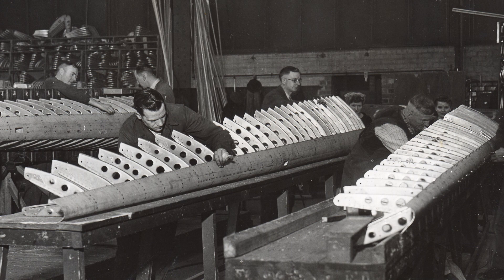To carry on from where we left off in previous videos, we're continuing to work on the trailing edge. Up to this point, these ribs here are original. The rest of the ribs are all new build. From the donor aircraft, we didn't have a full set of ribs, so we've had to develop these ribs from scratch. We've made up a series of hammer forms and then form the parts around these forms literally using a hammer. This is a tried and true method going back to the original methods used during wartime.